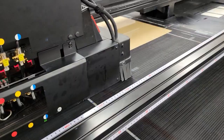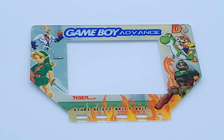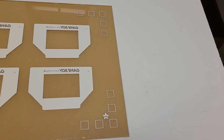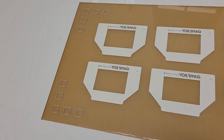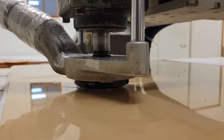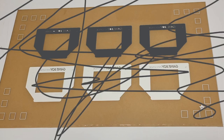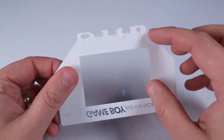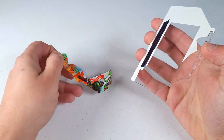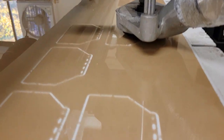The task in this case was to do what's called a reverse or mirrored print — printing on the back side of the media so the image would show through the front. To make that work, the image had to be flipped. Easy. But not using the correct material would soon come back to bite us. With the six good copies we had printed, it was time to move on to the CNC machine. Getting back into CNC has been a blast, but I was about to throw in a new variable I'd never seen before — milling a pre-printed part on media that was not designed to be printed on, much less subjected to heat and friction. The results were far less than optimal. The heat combined with the narrow spans between edges and buttons pretty much caused the ink to peel right off. So we had to think outside the box: CNC out the faceplates first, then print them after they were cut.